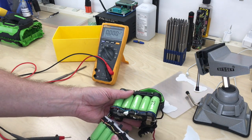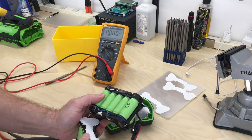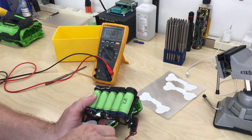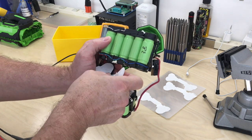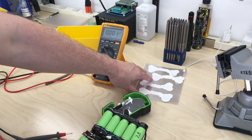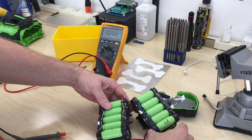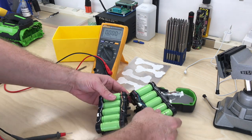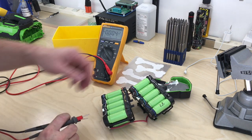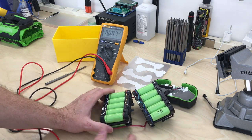I'm going to try my best not to let any cells touch. Since it's blinking green, I wouldn't have thought it'd be a cell failure — you'd think it would show red. So it may just be in the internal potted electronics, but at least we'll see what condition the cells are in. They're really nice cells.